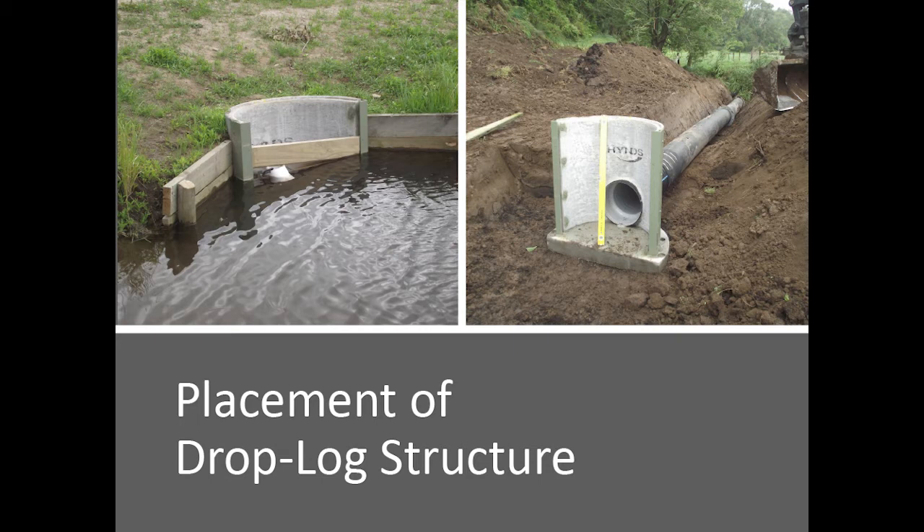When you put logs in here, there's a groove. You set your water levels based on those logs — it's still like a weir. So you can say, hey, we've got too much water. You pull the log out and it drops the level down whatever 500mm or whatever your log size is.